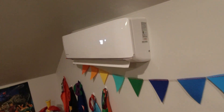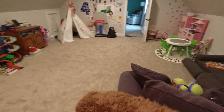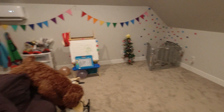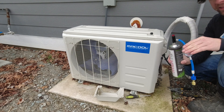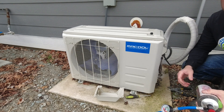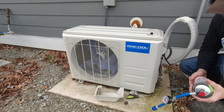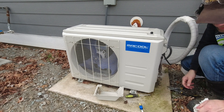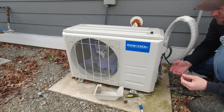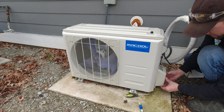This is only the 12,000 BTU unit. It's been fantastic for this playroom — this room is not connected to the whole-home HVAC system, so it's a standalone space and it's performed flawlessly. This one can of R410A at 28.2 ounces didn't quite get us to full as per the gauge, so I may order a second bottle — I won't need to buy any hose kits, so it'll be a little cheaper. It's performing really well already at 107 degrees coming out of there. For now I'm going to button this back up, let it sit, and see if it leaks down at all. Maybe we'll have to add five or ten more ounces. Cap's back on, cover's back on — as simple as that.